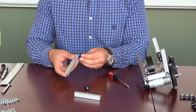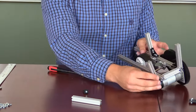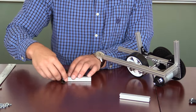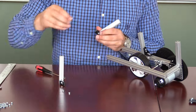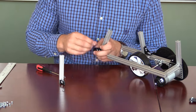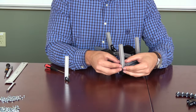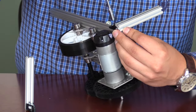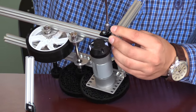For the next part of the assembly, we will have two lap brackets and two of the 9.8 cm pieces of extrusion. First, we will take each of the lap brackets and attach it to the base of the pieces of extrusion. These two attachments should be opposite of one another so that they mirror when they get put on. We will slide one of them onto the front of the assembly and the lap bracket should sit just behind — then we can tighten this down.